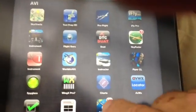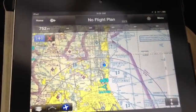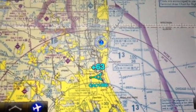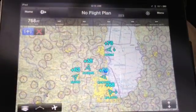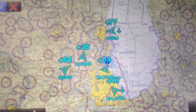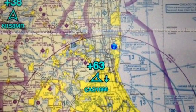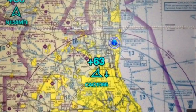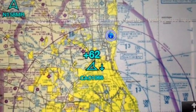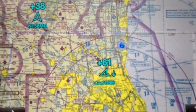Next, let's launch the Garmin Pilot software. You'll note that the GDL39 has already located and placed on the map a traffic alert. We've pinched the screen so that you can see that a considerable amount of traffic is pictured here in the greater Chicago area. You'll see that an arrow indicates the direction of travel, and a smaller arrow shows that this particular aircraft is descending. Beneath the symbol, you'll see the actual identifier for the aircraft.